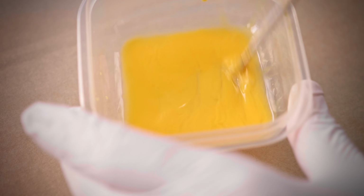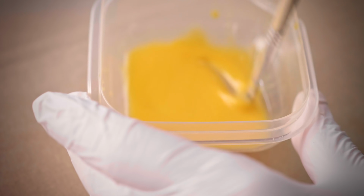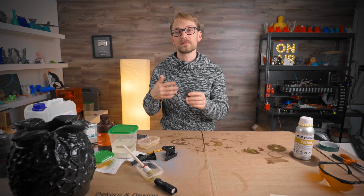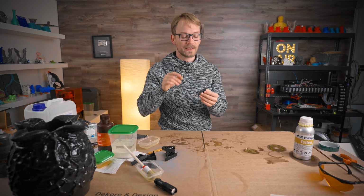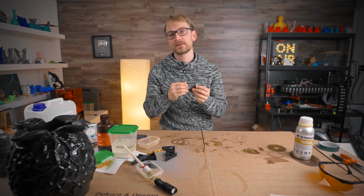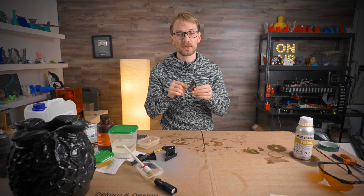Plus, we have the exact inverse of what we just saw with heat, because inside corners still have less surface area and more mass, proportionally to each other, in that resin pool. The solvent should actually evaporate more slowly in corners and keep the resin runny for longer there.